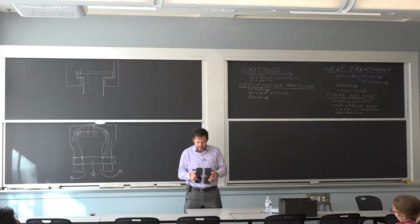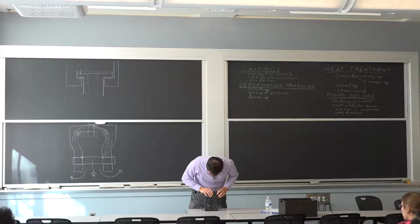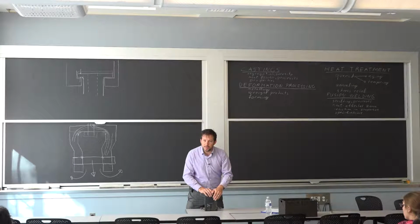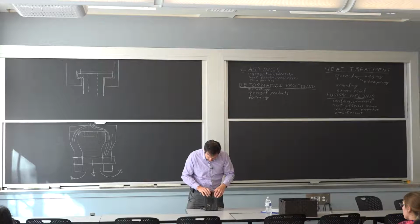I talked a little bit last time about blowout preventers for closing wells when we were talking about drilling. So here you have that drill pipe, the high-strength steel pipe we were talking about. It's going down, and we said that we need an annular space to have the flow of the mud coming back up. So this equipment fits between the pipe and the bigger hole. It's a little more complex, but for us right now, let's just keep it that way. So the bigger hole is only this big. It can be this big, but then you need more equipment.